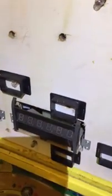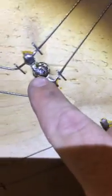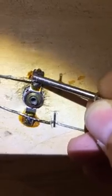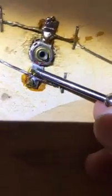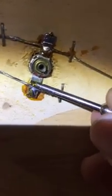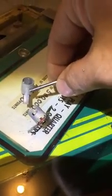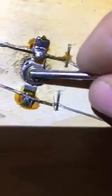Okay, if that doesn't fix it because it still is inconsistent or not working, the other more extreme step is to put some solder right on the back of the spring. Here's a brand new socket. You can see this spring touches this brass, which is connected to this end, which is connected to this wire. Whereas this one has that little insulating pad in between, so you're not soldering this one to the spring. This one goes to the body of the lamp socket, the outside edge, and the other one goes to the spring.